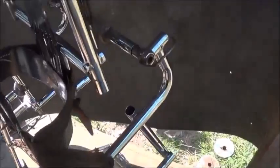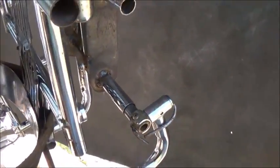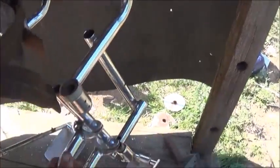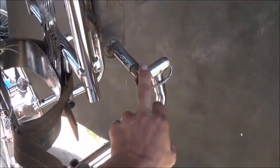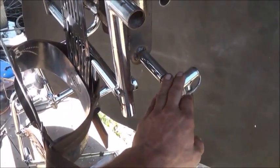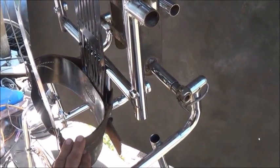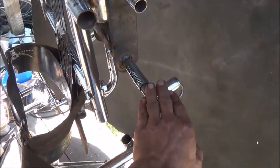Now the main pieces of this exoskeleton are right here. You want a bolt going through there with a nut on it to hold it into place. This is the main part of this exoskeleton project — designing this rear hip for the leg. Notice how far back behind where my torso is the actual hip is placed. This allowed for a much more free feeling of motion compared to the hip actually being right in line with my hip. I tried that first and didn't like the feeling of it, so I placed the hip quite a ways behind me.